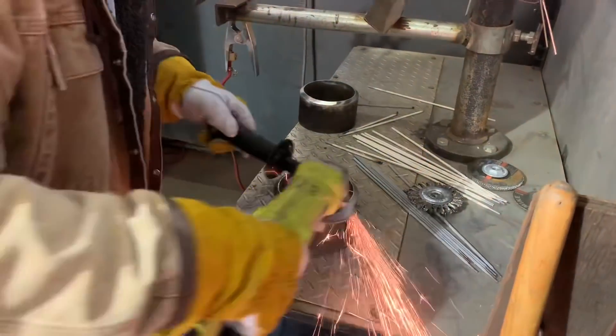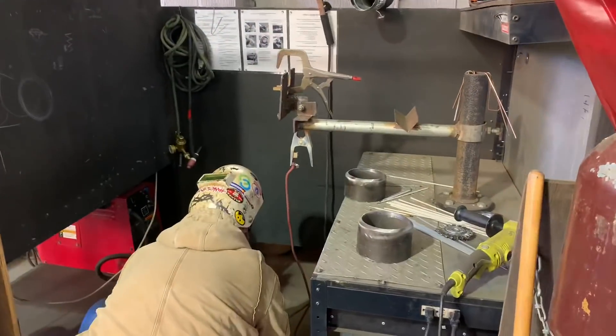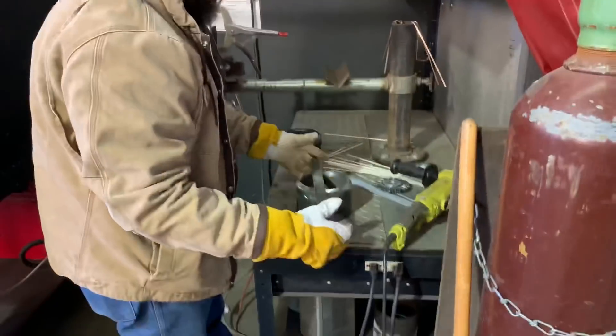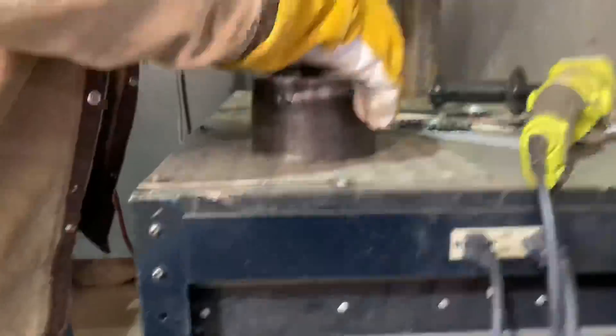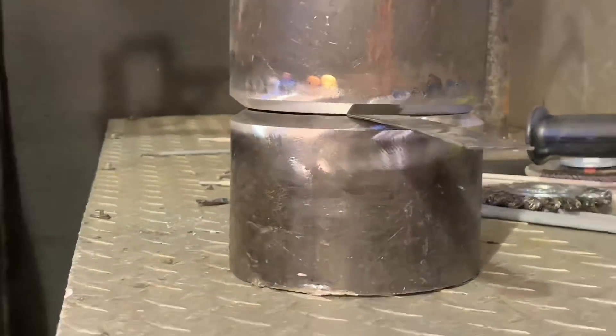You can see us here putting a nickel landing on it, and we'll use a saw blade for the gap, which is about a 16th. And then your tacks — we're going to put four because we're taking a little bit longer for filming purposes, but usually we just put two: one at the bottom and one at the top.